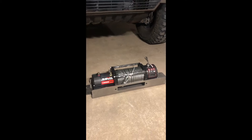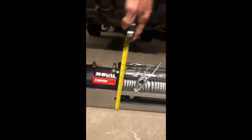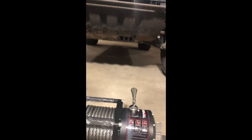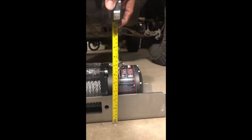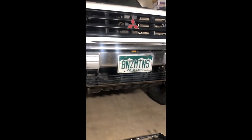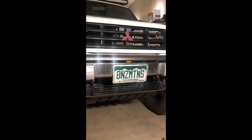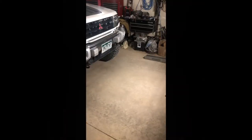You're also going to want to get some measurements first. Checking my height, I'm right at seven inches on the body, but you've got to consider your clutch to disengage — so you need clearance for that. In this case I'm at about nine inches. I may have to move some of the transmission cooler or other components once we get things set up in there.